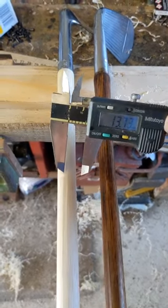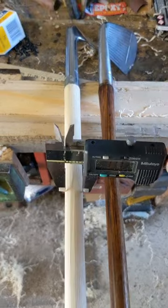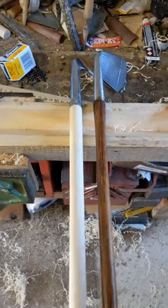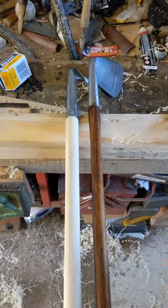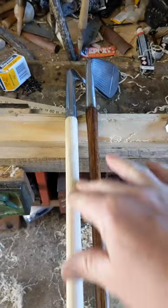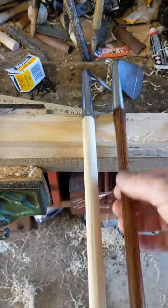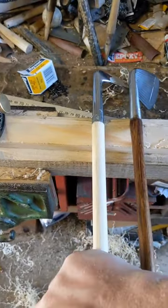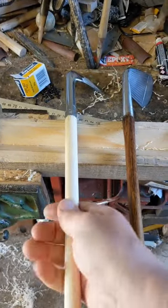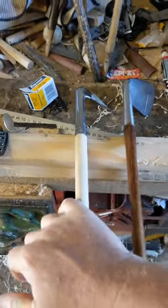But what you must do is take this very slowly in terms of taking material off, because different woods, be they hickory or ash, and sometimes I work with ash, but this is actually hickory, they behave very differently when you get to the point where you're just on the point of getting some nice life in the shaft. This shaft at the minute, when I waggle it in my hands, is still very lifeless. It's like swinging a broom handle. There's hardly any give in it at all.